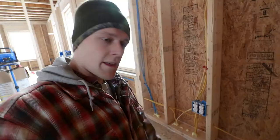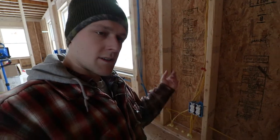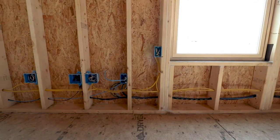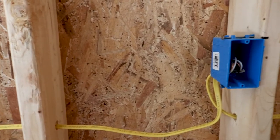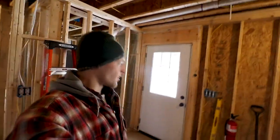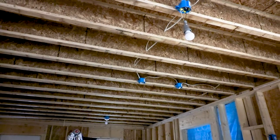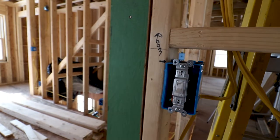Dad has hitched up several outlets for temporary use. The outlets will have to be unscrewed, tilted, or completely unwired come drywall time, because the little tabs are going to be in the way to get a nice clean cut for getting that drywall in place - which hopefully won't be too long from now. Along with a few temporary outlets, we also have a few light switches wired up in the hall, in the dining room, and we've got some lights in the kitchen as well.